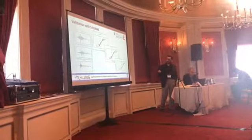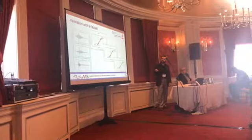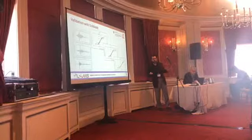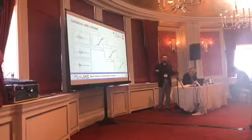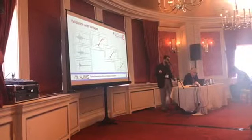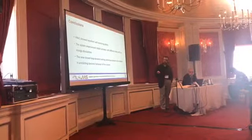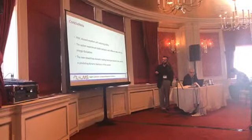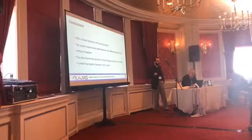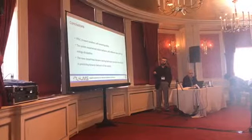And so this technique gives us a way to understand the dynamic response of the system in cases where we don't have a fully equipped lab with shake table testing and hybrid testing equipment as well. So in conclusion, as I showed, the piston-based self-centering bracing showed an excellent self-centering ability with a minimized amount of residual deformation, which is a potential option for bracing systems in different buildings.